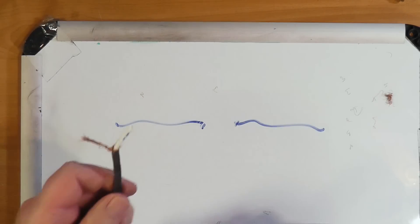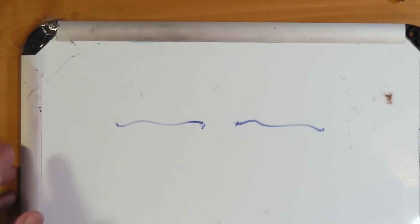That does make it rather permanent, though, and there's nothing wrong with that if you're going to leave it up for a while. If you don't like the antenna, you can always just cut the coax right there and you'll lose a couple of inches of coax — and that's no problem. Now, let's suppose you're going to make an antenna and you think you might change it a lot, or take it down and put something up. That's what happened when I did the 40-meter dipole that is in the video he commented about.